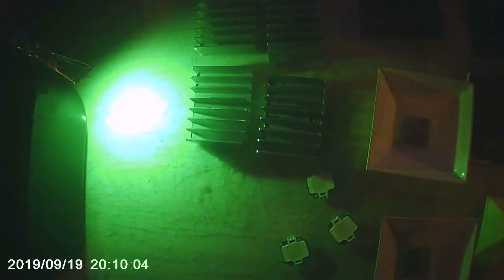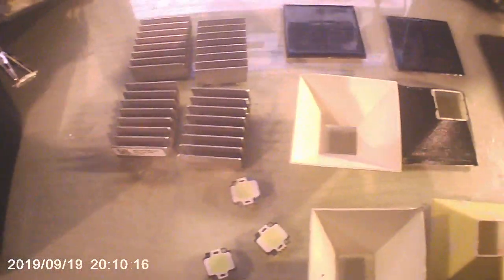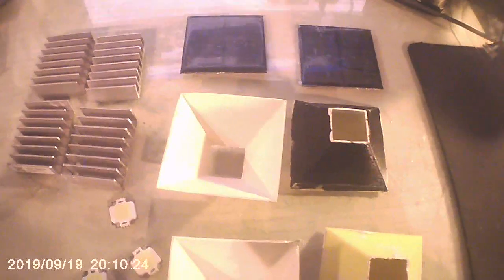Well, this is the inside of the new Neumann switching box. Four housings for the lamps — solar panels fit in the top of them and the LEDs fit in the bottom. These are for isolated switches, so we pulse the LEDs and we use the pickup current from the solar panel to switch the transistors. Transparent box. I've tested a whole bunch of different LEDs — red, green, blue, yellow, RGB, UV, ultraviolet and IR — and green is the best by about 20%. The solar panels pick up green at least 20% better, in some cases 40% better. I'm going to click back to the footage of it being finished and show you how it works with the Neumann machine.